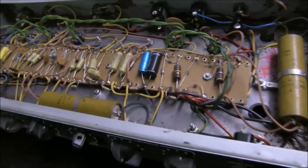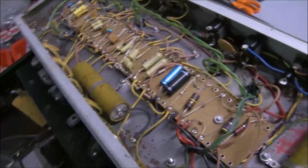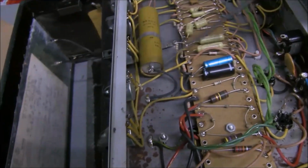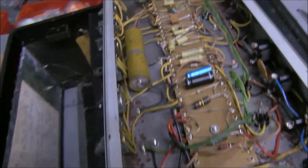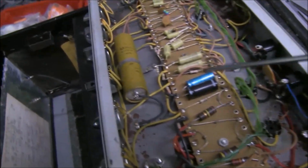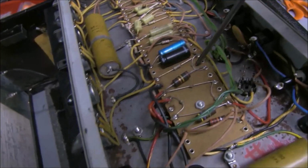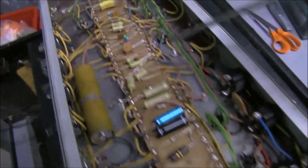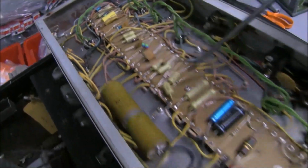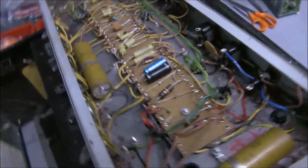We can go over the circuit diagram before we test it. Everything looks good. No swellings on the capacitors. No other capacitors in here. Normally you get the big round capacitors that stick through the chassis. Instead, they've gone for these long ones. They must be sufficient. Now, this would probably be a bias here, and yeah, bias will be off this diode, smoothing capacitors and some bypass capacitors on the cathodes of the various valves. All pretty straightforward, nothing unusual.